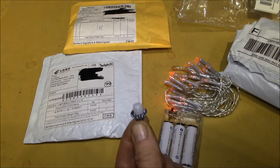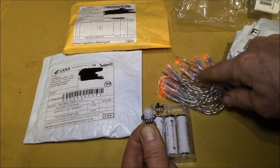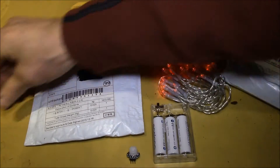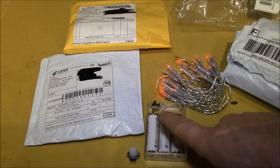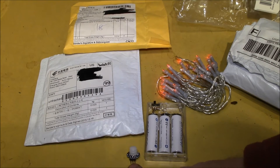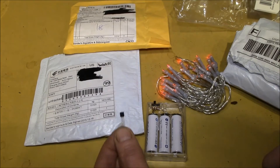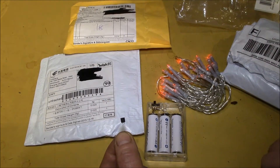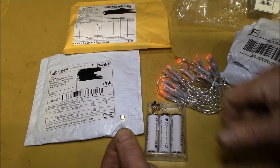The plan is to wire one of these into the battery pack to detect motion and turn the lights on and off. But there's not enough drive current in this device. One reason I need a four-battery holder is I need 4.8 volts — this runs down to about 3.3 volts. I also need to add in what came in this package: a bunch of 2N3904 NPN switching transistors.